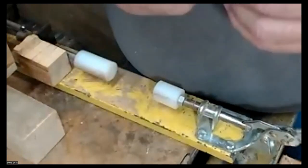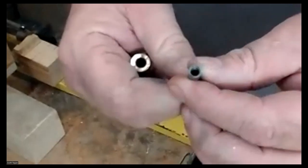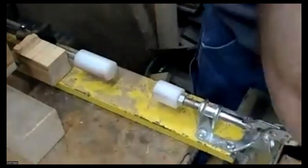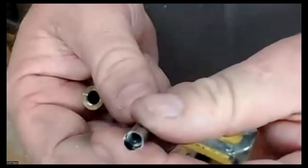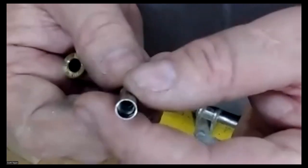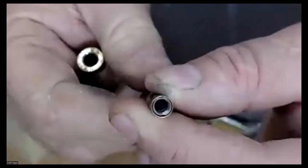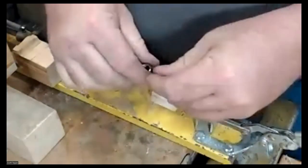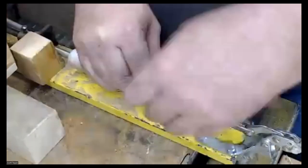Now you're going to take your transmission. I always make sure that the transmission is screwed all the way closed. Otherwise, you can wreck these transmissions when you press them together. That one's locked. You can see that one is screwed down inside there. That transmission is considered open when the pen point would be sticking through the nib. You want to press these in when it's closed like that. That keeps you from crushing the transmission when you put it in the pen press. Ask me how I know.